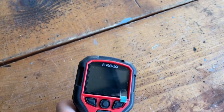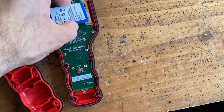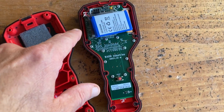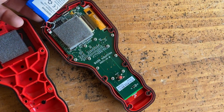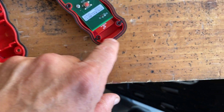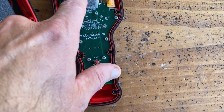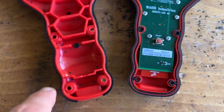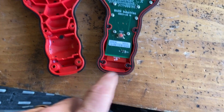After taking it apart, a couple of things I realized: one, it's not a NiCad but a lithium-ion battery, which is still not prone to fully discharging within two weeks. There's the USB charge port, and the battery is replaceable, which is nice. It's also sealed up so it's liquid-resistant. One of the first things I thought I would do is cut the positive lead and put a switch in here — there's about 5 millimeters of space to fit a switch.